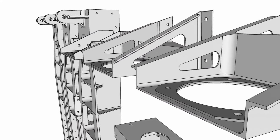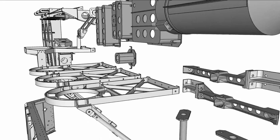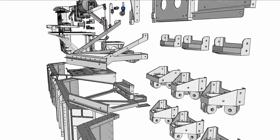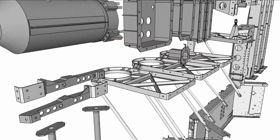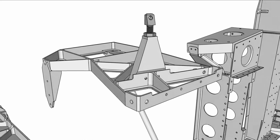Every aspect of a component must ultimately be defined in a deliberate numeric manner: fastener hole diameter and spacing, fillet radius, material thickness, etc. Even with a large and growing collection of published dimensions and directly captured measurements, many details of a component's geometry must be carefully estimated from drawings or photographs.